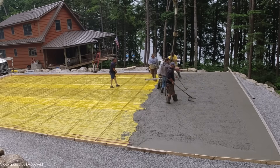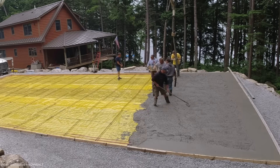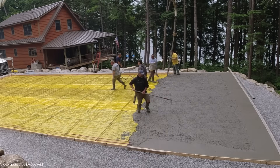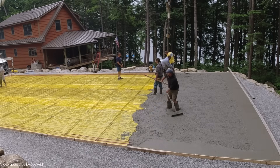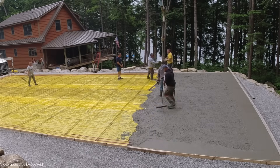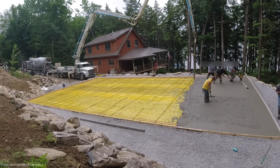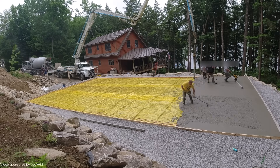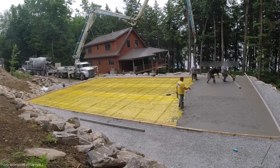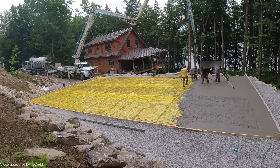That's me with the grade stick. I'm going to shoot my pads based on the height of the center. This pad I'm shooting here will be an inch and a half higher than the two-bys on the outside of the perimeter. The homeowner wanted to make sure he had at least four inches of concrete all around the outside of the perimeter, but when he graded that crushed rock he just graded it flat. So this is about five and a half to six inches in the middle.